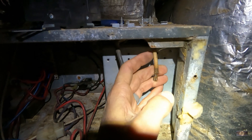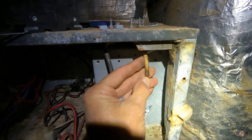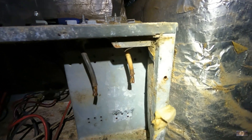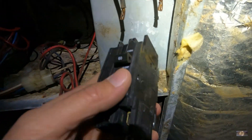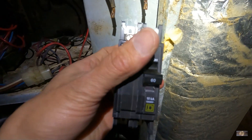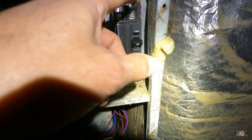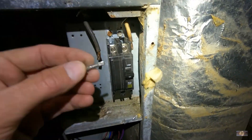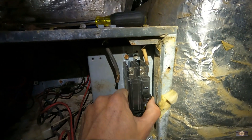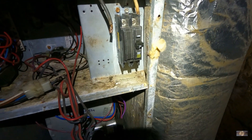Since I have this off, this is a white wire — by code, that should be marked black as a hot on a 230/240 volt unit. So I'm going to mark that with some black tape. I can't quite reach all the way to the back, but I'll go up a good ways to mark that as a hot. I'm glad I had this — I keep these in my van. This is my last one so I need to restock. I got the inline breaker mounted. I had to put a hole in one side kitty-corner — I just took a self-tapping screw and drilled a hole with my 12-volt impact. It's mounted in there now and it's not going anywhere. I'll go ahead and mark this white as a hot and then start swapping these wires out.